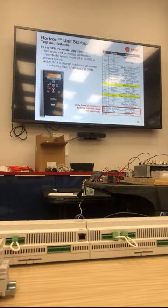It's also worth noting, I know you made a comment about the custom programs earlier. If the programs change from the factory, and you do that without calling us, we would prefer that you send us the program and we'll keep it on file. That way, if we get a warranty replacement for the UC, we can load the correct backup in there before we ship it out. Three years down the road, a contractor calls saying we need a UC, and we don't have the right one that's been changed. It could cause issues in the field and a return trip. So if there's any custom program done, we'd like to have that back, just to keep on file.